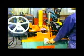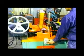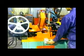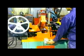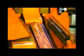The hydraulically operated L-type shear will then lower, cutting both coil ends at the same time. This reduces the overall cycle time of the machine, since the shear needs to cycle only one time. The design of the shear ensures that there is a uniform cut across the entire strip width. Notice that the design also puts the distortion of the shearing operation in both scrap pieces. These scrap pieces are then automatically discharged through the center of the zip welder.